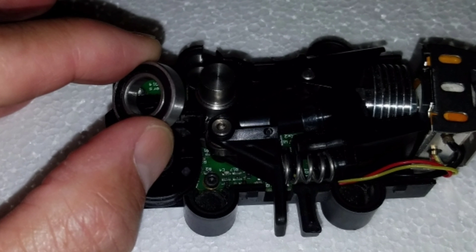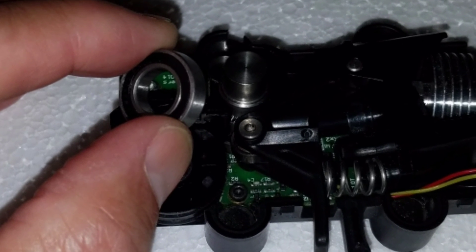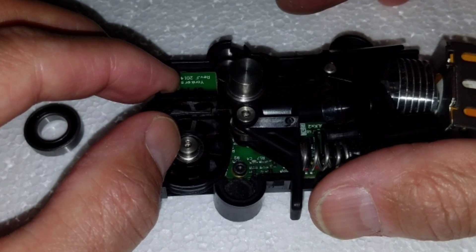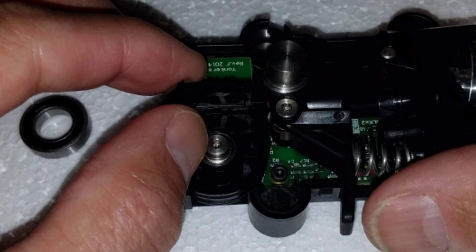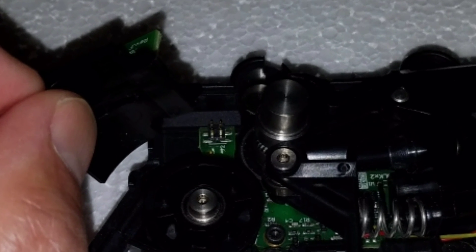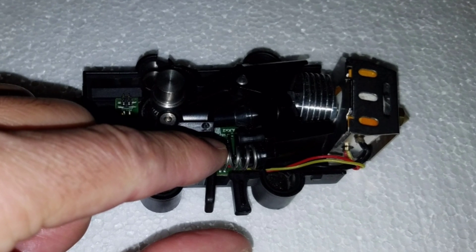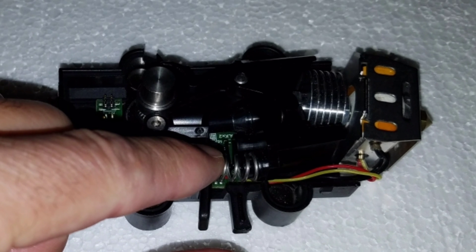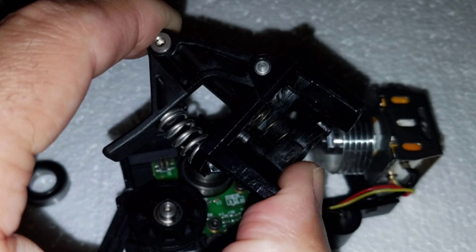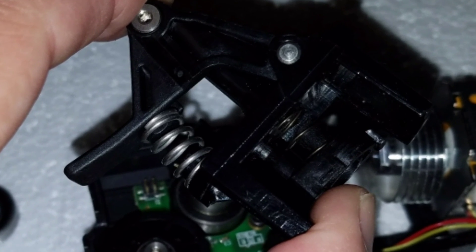Make a mental note — take pictures if you have to. First, remove the bearing. Remove the filament sensor guide by pulling it upward; you'll see four little pins. You can start by removing where the spring is, those two little clips — just pry it up. It should come out just like this. Be careful with the spring; you don't want to lose that.